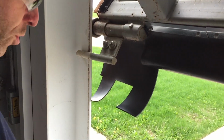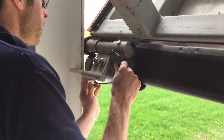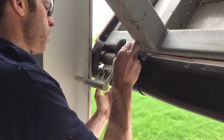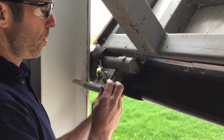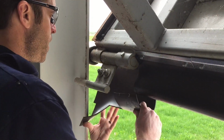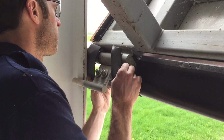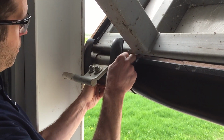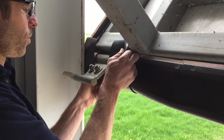So once you have it trimmed, you can check to see how well it fits. So this is still hitting, so that's all I'm going to do is trim a little bit further to make the notch a little longer. You want this so you're not lifting up the hinge off the flange of this column. So once you have that, then you're all set.